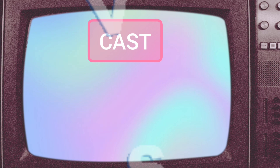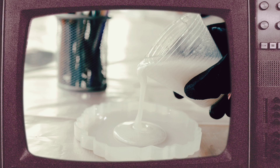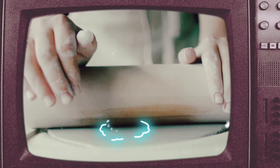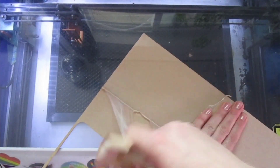Let's go over the difference between cast and extruded acrylics. Cast acrylics are poured into giant molds — the thicknesses can vary, but it is the best for engraving. Extruded is squished between rollers so the thickness is more consistent, but it melts easier, making the engraving look more melted rather than etched.